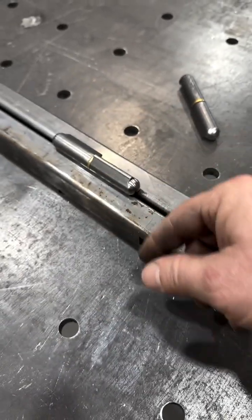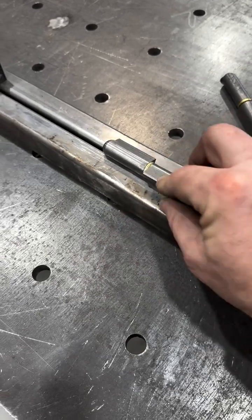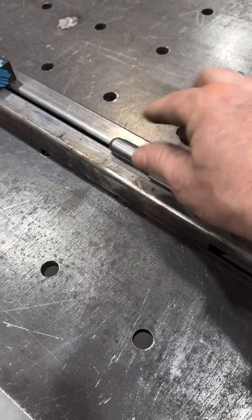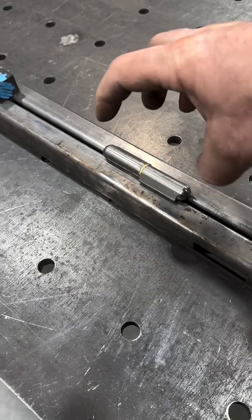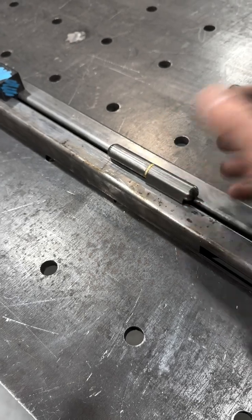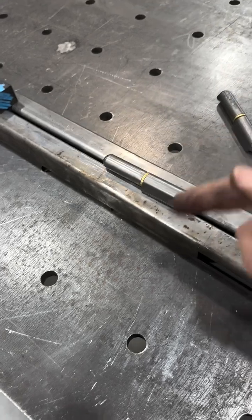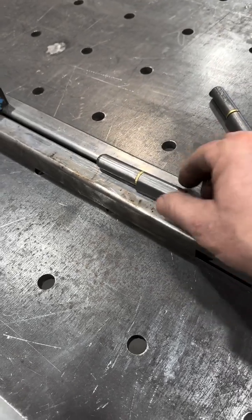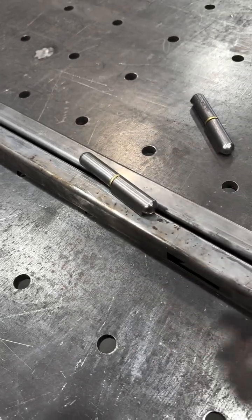These are the four inch bullet hinges we use on our doors. We always had issues placing these to make sure that they're nice and square — no twist to them — and also that they're offset enough so that when they get powder coated, they don't rub. You could either zip tie them to give a consistent offset off of the frames.